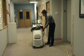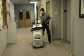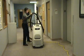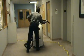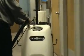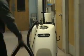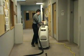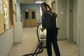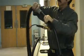Secondly, we will hook up our vacuum pressure line. The pressure line hooks up to the outlet QD, and the vacuum hose hooks up to the vacuum inlet. We will then hook up the Evolution wand — pressure line to the metal QD on the wand, and the vacuum hose to the end of the inch and a half tube.